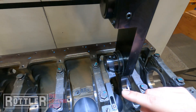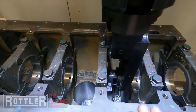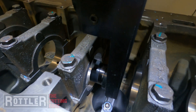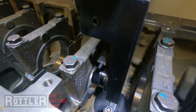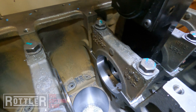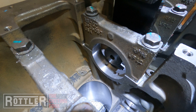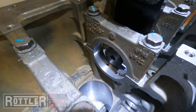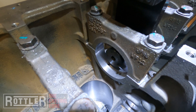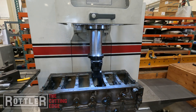Something to watch, especially on your first one — if all looks good you can let it run. You'll notice the cutter indexes: when it gets done with the bore it's always starting and stopping right there at that split line, so it doesn't leave a witness mark.